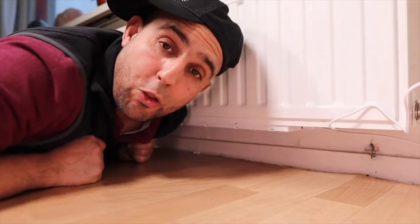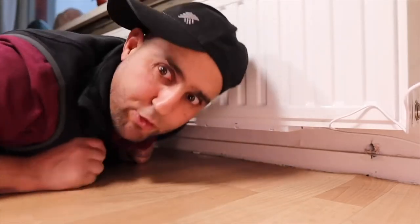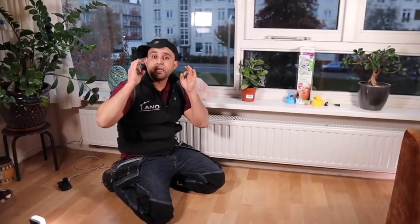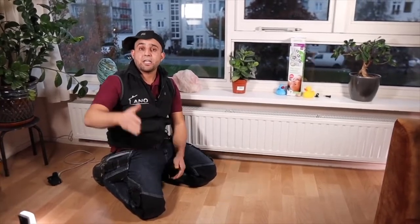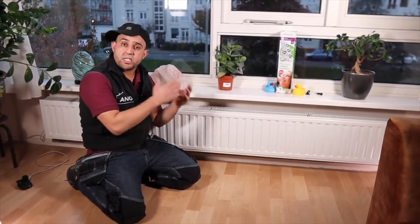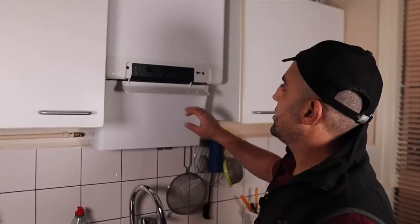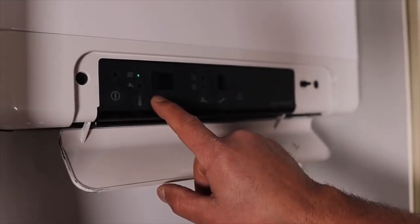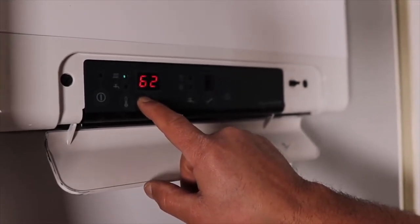Installation is finished. These fans are on. All I have to do now is lower the temperature of my central heating water. In a standard installation this is often set between 70 and 90 degrees. I'm going to lower the temperature to 60 degrees now, then see how it feels. If it's just too tight, I'll raise it to 65 or 70 degrees and we will see what happens.